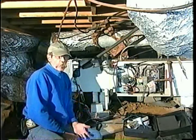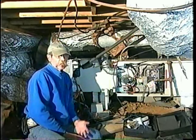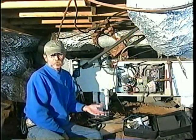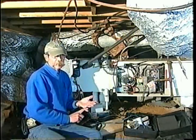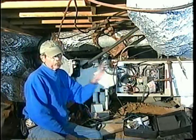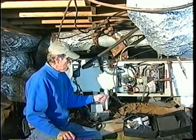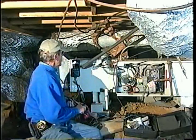You've got to have 400 CFMs per 25,000 BTUs. This furnace is about a 75,000 BTU furnace, so we need about 1,200 CFMs — it's based on tonnage, every one ton needs 400 CFMs. It's really important on the cold side because cold air is hard to push; if your duct size is too small it's not going to move that air. I've got a little problem with this furnace that I'm actually going to have to red tag it, so I'm going to crawl over to the back side and show you something.